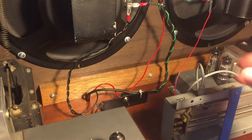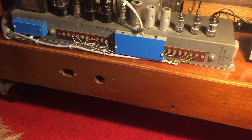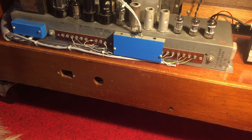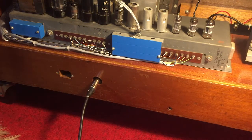What you can do is tap directly from the amplifier output and get a wire connected to a jack on the back. It's not really safe to connect directly, because you could screw up everything — but this is what I do. The jack output here, which you can connect an unbalanced jack to on the back, is directly connected to the output transformer. So the signal you're getting out of this is directly the signal that goes to the speakers or the resistor — I'm tapping directly from the output transformer.